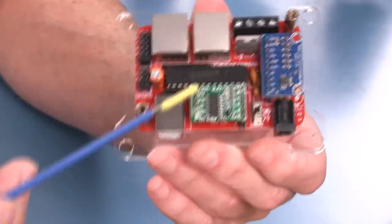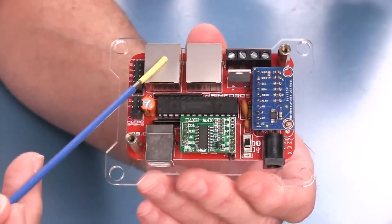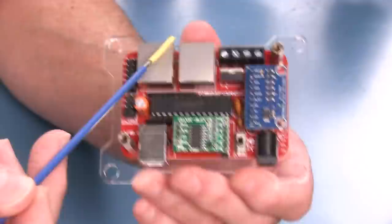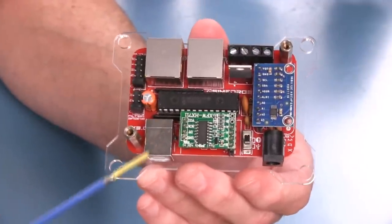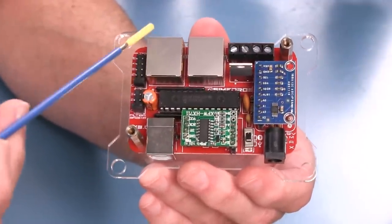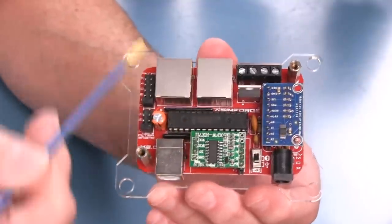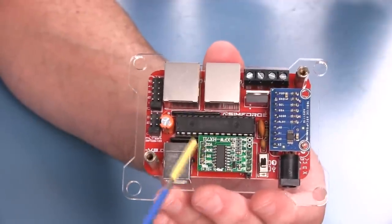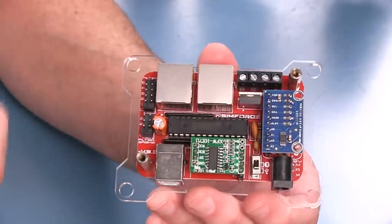So another good thing to help mitigate EMI is to plug in all of your electric motors into the same circuit in your house wiring. That way, it can only go to the ground that's outside your house. So in other words, if we had another signal coming in another circuit, that was also loading it, dumping itself on the same ground that's in your electrical box in your house, it can actually get noise feed or loop back to the other circuit.